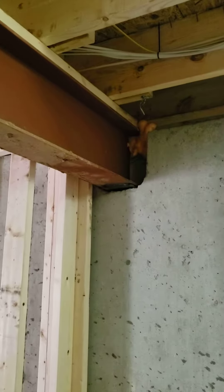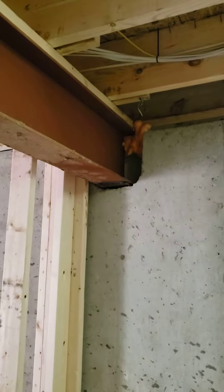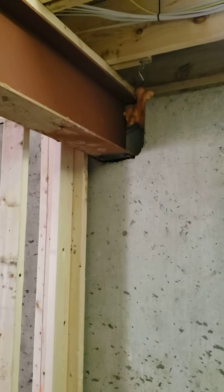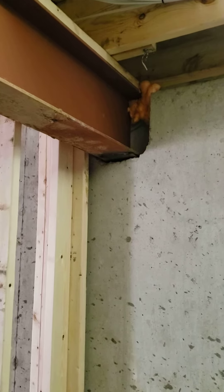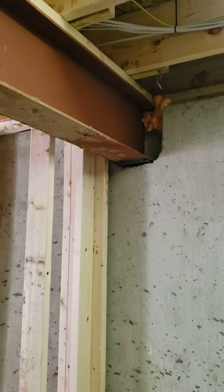As you can see, we have a nice I-beam that goes directly into this foundation pocket. These pockets are supposed to be completely poured with mortar or with concrete to hold them in place. These are very, very important small details of these homes that keep everything right in place and prevent a whole bunch of movement on the home.